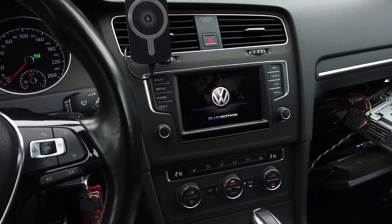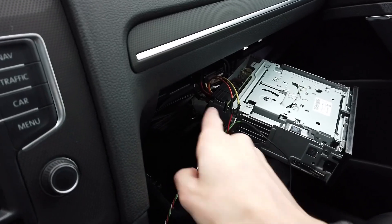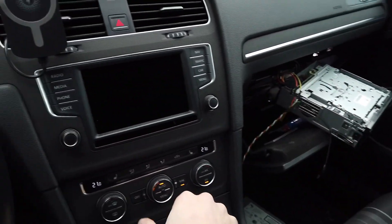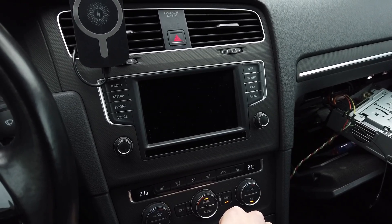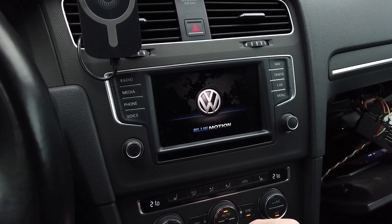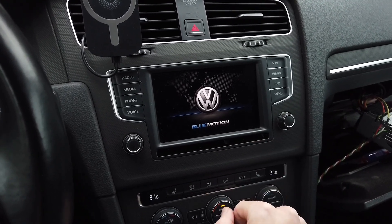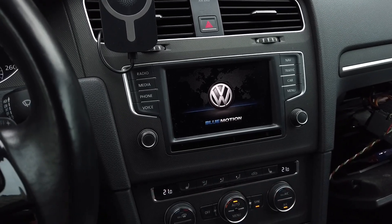To prevent battery drain you will have to disconnect the unit from the car, so you need to remove the quad lock. You will need removal keys to slide out the main unit. I've tried to fix it but I'm not there yet — you can see that I'm in a boot loop right now. The unit tries to boot up but all we can see is the Volkswagen logo; that's as far as we can get.